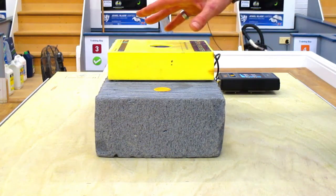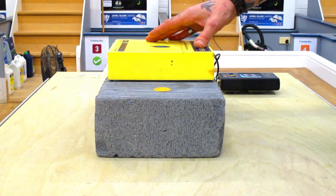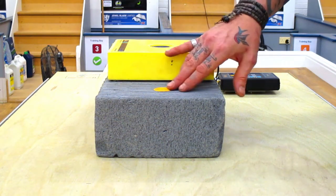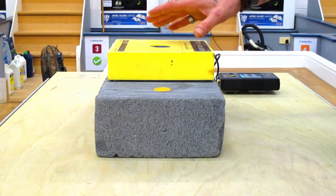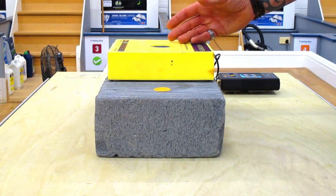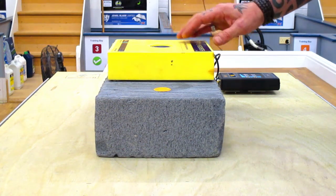With the testing methods, we have the hygrometry box in position and also the drilled sleeves in position — both testing the subfloor. The sleeve tests down to a certain depth, while the box catches a pocket of air underneath, measuring the amount of moisture being released from that subfloor.